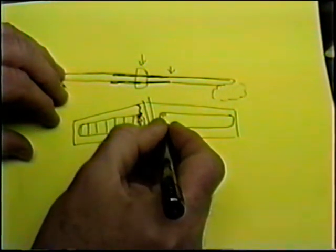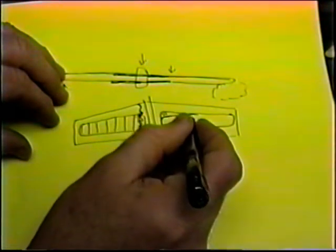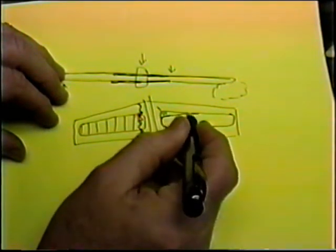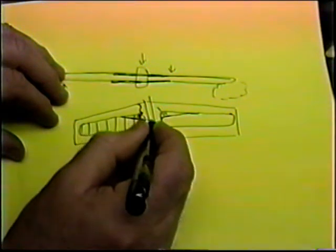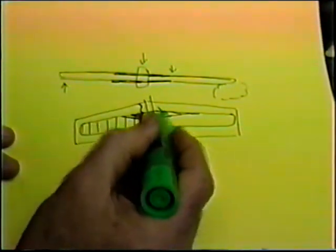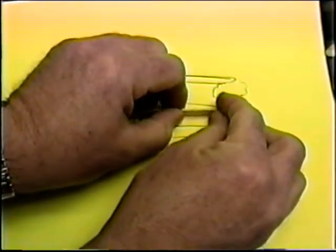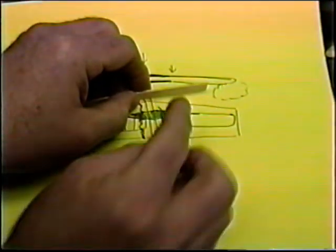A better way is to take the sheeting and let this sheeting just go out. And this is what Les is doing. Make it a bigger piece. This sheeting should not have a corner in it. It's the corner where the stress riser is going to be. If you look at a Cardinal plan or some of the designs I have, that's just a good way to do it. By doing that piece on both sides, which is what Les is doing, it gives you this area here that's very strong. But rather than being a point where it's strong and then it's not strong, it kind of distributes the span loading stress riser out there.